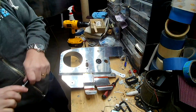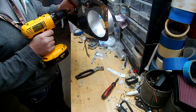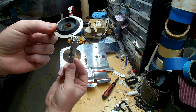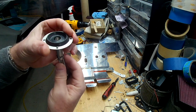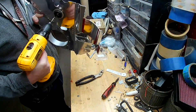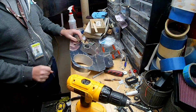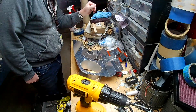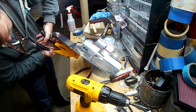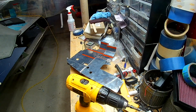This is really cool — I've been trying to find something to put on the baffles so I can get the fuel lines through. This is it: the Easy Seal. Here's a sample fuel line — you can see it pushes through the rubber, so you can push the bigger fittings through the rubber and then have a nice tight seal on the line itself. That's the problem with these AN fuel lines: the fittings are three-quarters of an inch but the line is only 9/16, so you need a big hole and the rubber grommets just don't fit very well. This is a good solution — it's a metal ring with a nice rubber grommet in the center, and they sell different shapes and sizes.